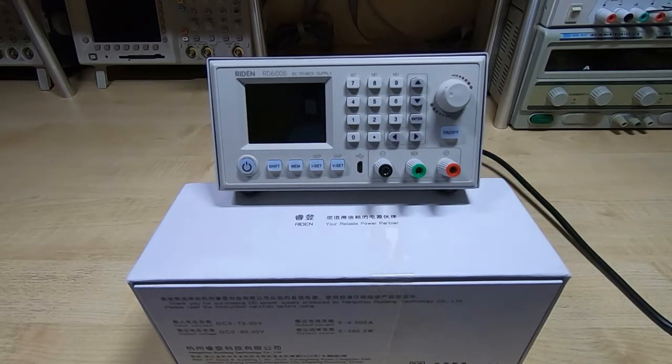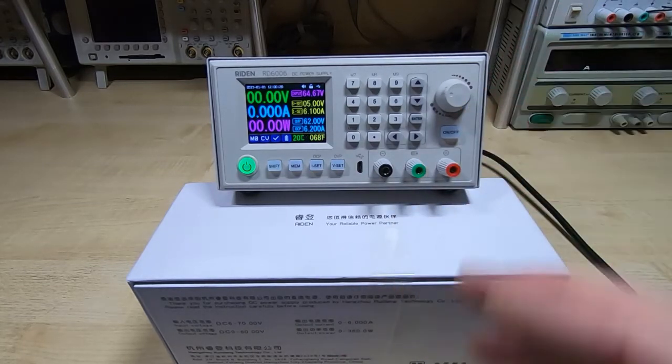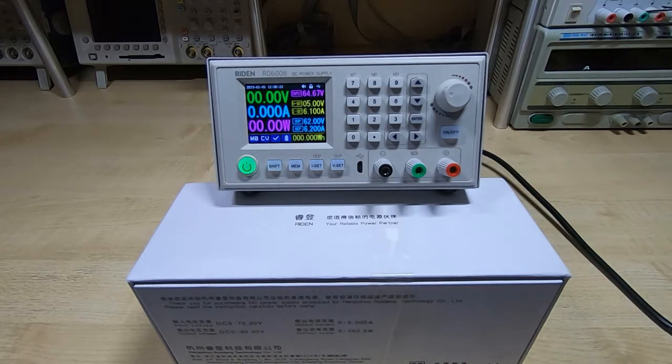I'll just power it up. And it's still working fine. So this should now give me up to 60 volts at up to 6.1 amps and around 360 watts. So of course that's a very good performance supply. It also has a battery charging software that comes with it, and what I'll do in the next video is put it through its paces. We'll give it a good test, see how well it works. We'll test the software, see how well that works, and hopefully it will be a useful addition to the lab.